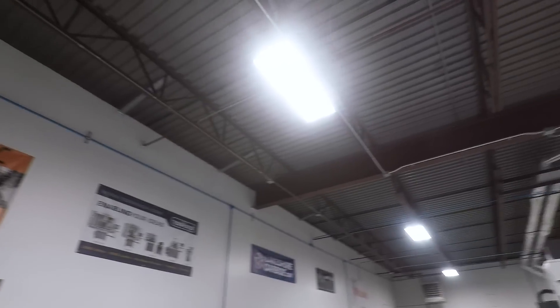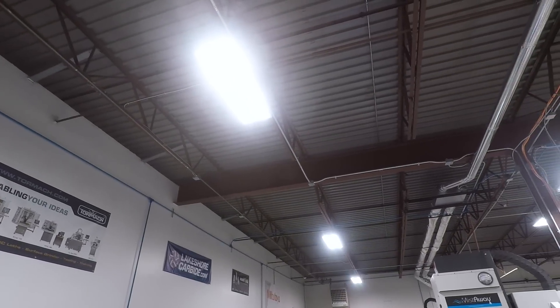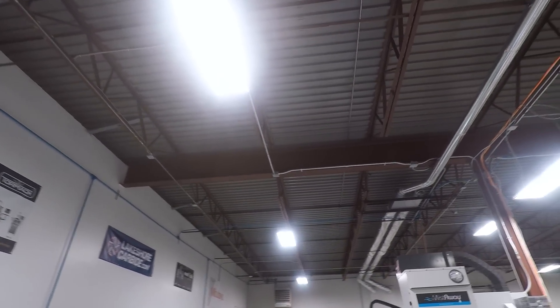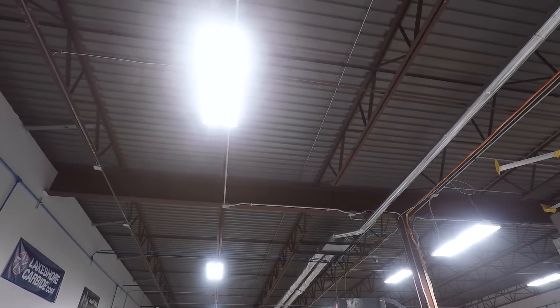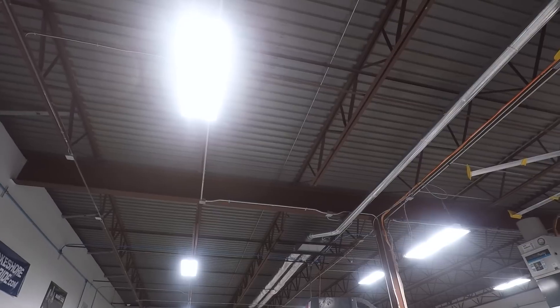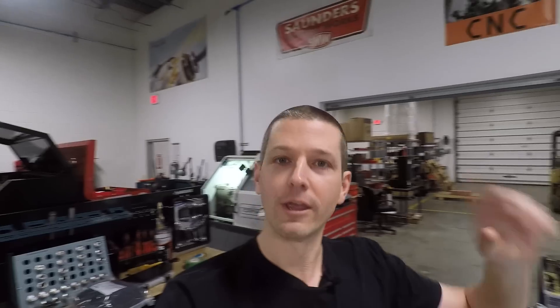Also still really happy with our lights. In hindsight, they weren't that expensive. They're 5K, 90 CRI LED lights that offer, I think, 50 foot candles. If anybody's really interested, we have our lighting plan for the shop — we can throw it up on the NYC CNC site. Having a bright shop, the lights have been low maintenance. They turn on right away. The only thing we've had to do is maybe once a year go around with a scissor lift, pull the covers off, and get the bugs and dirt and debris out of them.